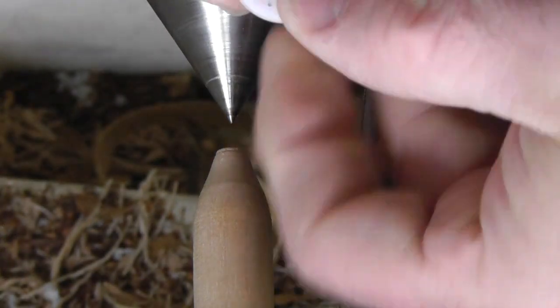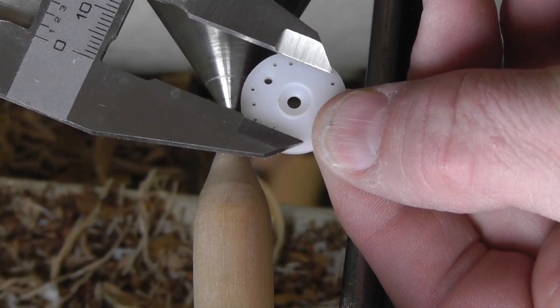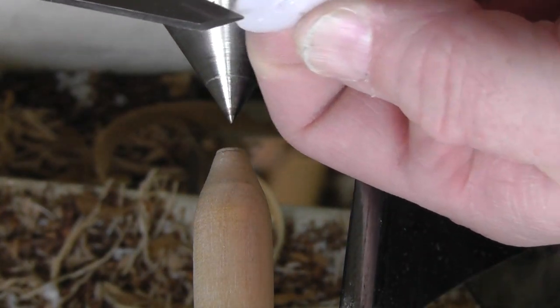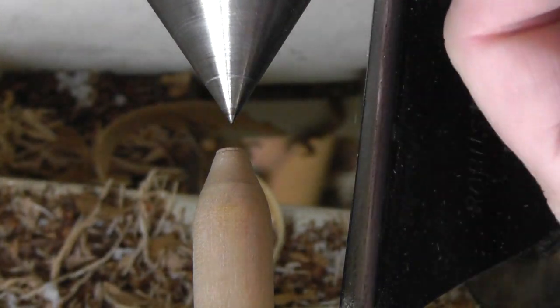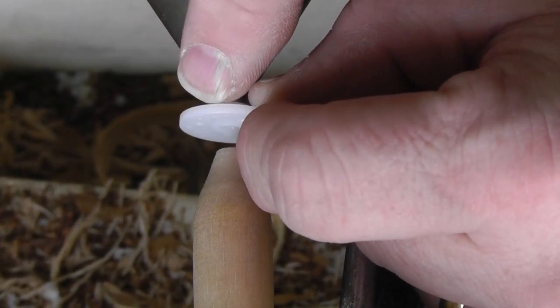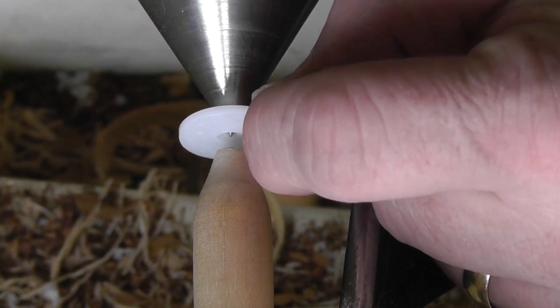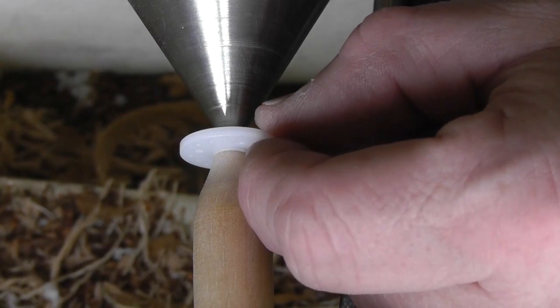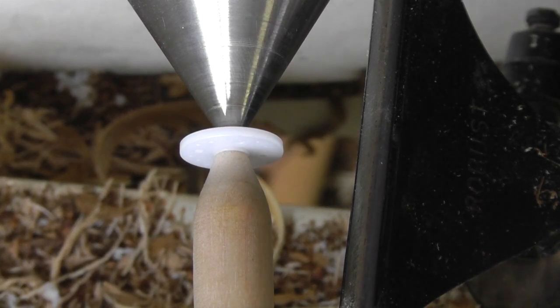Here's the servo round horn. I want to cut it down to about that size and then put a groove for a pulley in this area right here. This is a wood lathe — not a metal lathe or anything a person would typically have, but I like to turn wood. I have a live center here and I'll put the hub up against the live center, then use this little piece of wood as a jam chuck — it jams in there nice and tight.